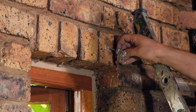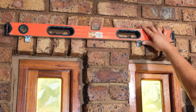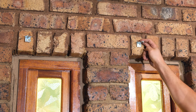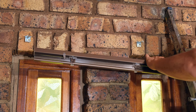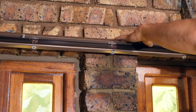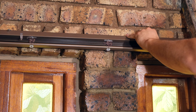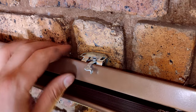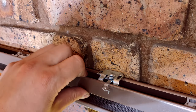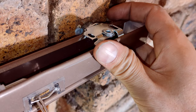These are slightly fatter washers and I can always add more if needed. I take my spirit level and check that the brackets are horizontal — yes, correct between all three. I make sure the screws are tight. Now the beauty of this system is I can slot the blind in in one go. There's a lip running along the top and two fingers on each bracket which hook into the lip. I make sure the levers are open — if they're not open, the blind can't move in because it's blocked. Levers all open, I twist it in and use the lever to hold it in place: one, two, three.